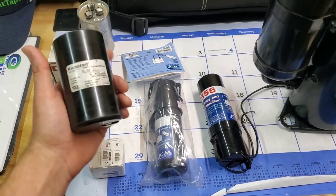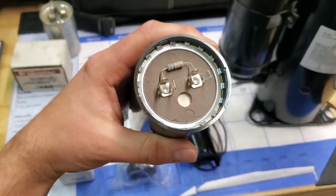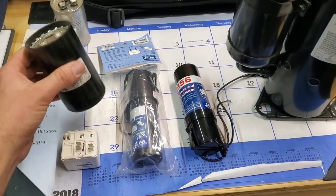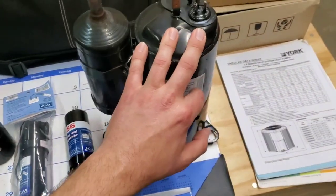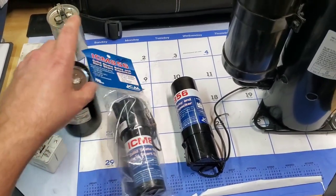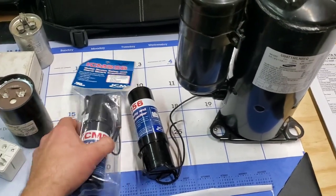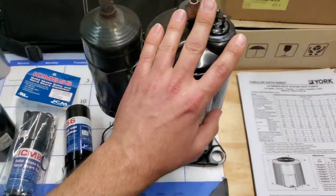What can you do? Have an HVAC technician come by and check your starting components to make sure they're working properly. This is a start capacitor — it's used to start the compressor and it's rated for certain microfarads: 324 to 365, and 356 is what this one is rated for. When you check it with a meter, that's what you should be reading. This is a potential relay, used for dropping the start winding out after the rotor starts turning and reaches a voltage threshold. This is called a hard start kit — basically the relay and start capacitor all in one — and it's an accessory many companies stock on their service vehicles to help equipment run more efficiently.